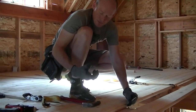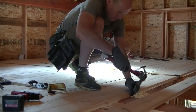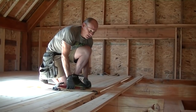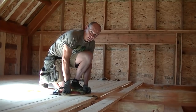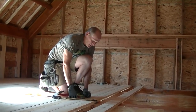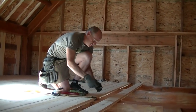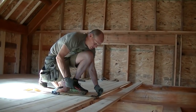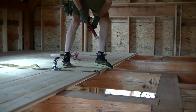And I've got finish nailers, but I don't have anything that's going to take a 3-inch nail. Now we do our floors for down there. We can, Dave has a 3/4-inch flooring nailer. Okay. And so you put big staples in it. Mm-hmm. And you just whack it with a hammer. It lines up perfectly with the groove, and then you just whack it, and it puts a staple in. You can't put too much tension on it because it'll flop right up. Mm-hmm.